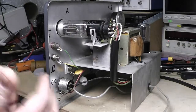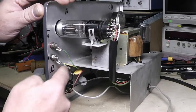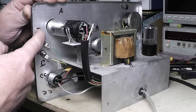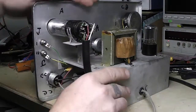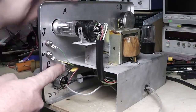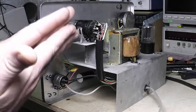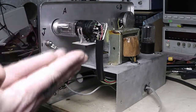Especially where pieces of metal come together — because if something needs to have another part of the circuit screwed to it for its ground, say your main power supply, and it gets loose enough in there that it doesn't make real good contact, you're going to start having intermittent issues where that ground is, or arcing.